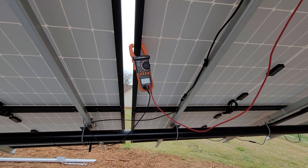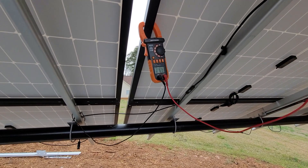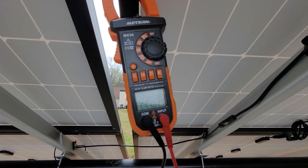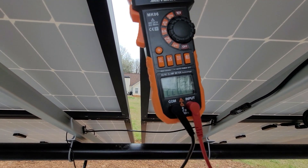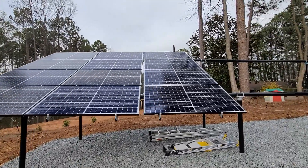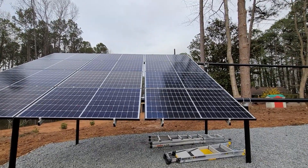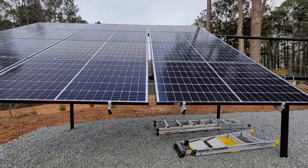So that's what I have at this point in regards to voltage: 226.7 volts. First day's work — 12 panels, 6 series 2 parallel. And no, your eyes are not deceiving you.